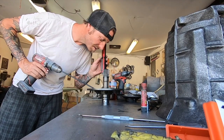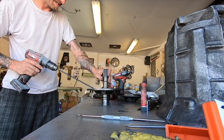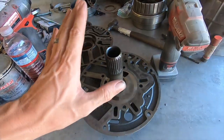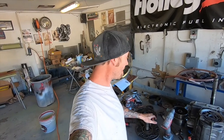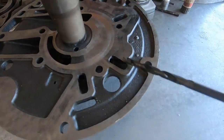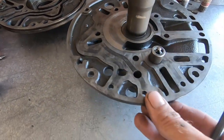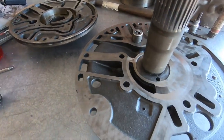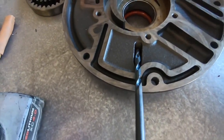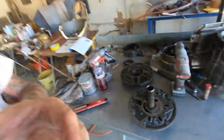The intersecting hole was already quarter-inch, and we just drilled that one out. Let me find the adjacent holes on the case and do the same — then we are done with the pump. It turns out mine is already drilled. Pretty much the rest of these holes are already quarter-inch — quarter, quarter, quarter. There's a relief hole, and then the new one we punched out, and then the same thing on the opposite side of the cover — that one's quarter as well. I think we are good on all that stuff.